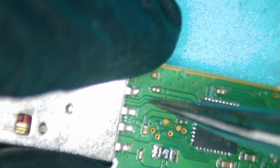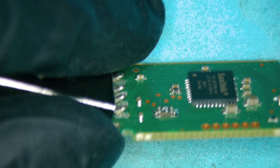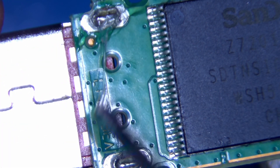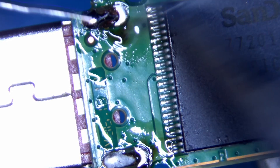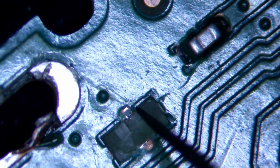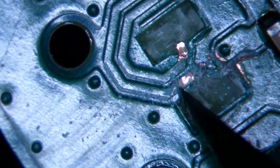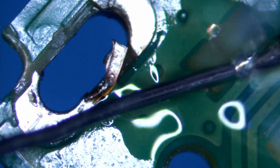When the coating gets ripped and the pad gets ripped, it's not something you can just touch back with a tweezer and have it be fine. Most of the time you have to do a little more surgery. What we're going to do today is remove this USB head and connect a special tool we have for these situations. We're going to recreate where those damaged pads are — each pad has its own special connection and different trace lines going to it.